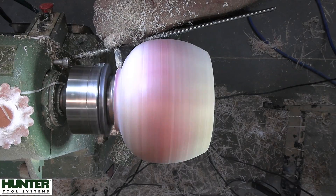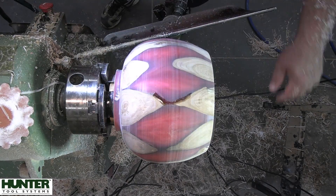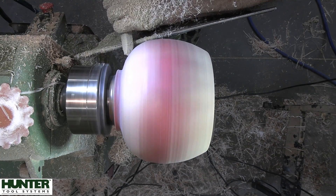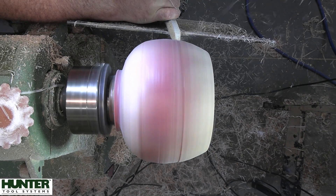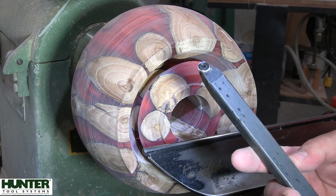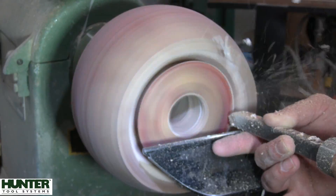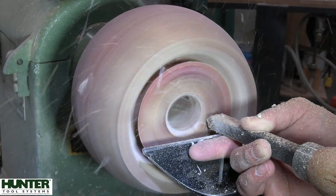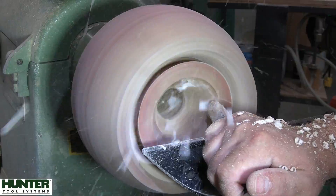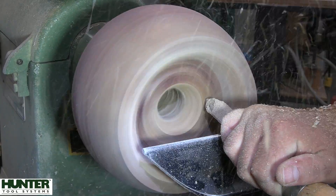This is the next day. When I put this piece on the lathe the day before, I could push my fingernail into the resin and leave a little dent with some effort. The next day I wasn't able to do that — so it's good to go. The problem with shooting YouTube videos is it takes some time to set up the camera and other stuff. I was just showing that I had put a new cutter on the Hercules. You can see this is all end grain and resin — a very tough thing for a high speed steel gouge to do. This is where carbide tools will be superior over gouges and the likes.